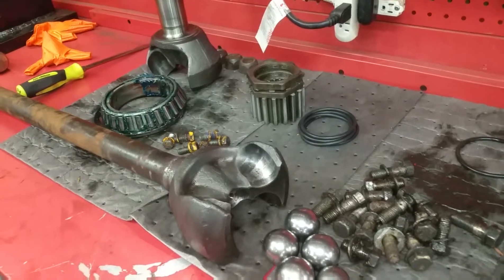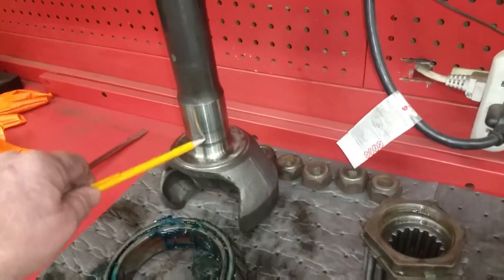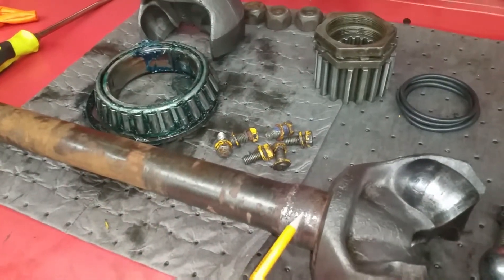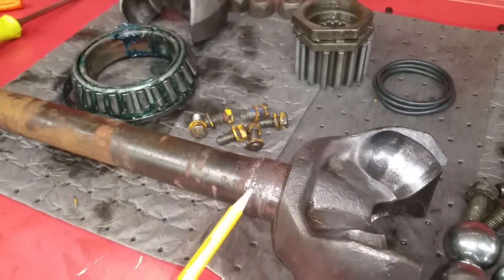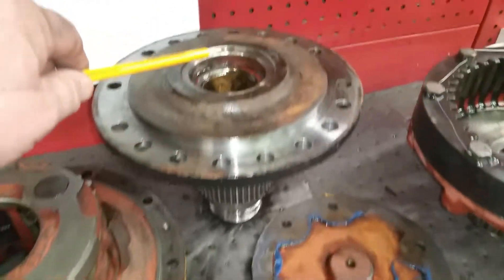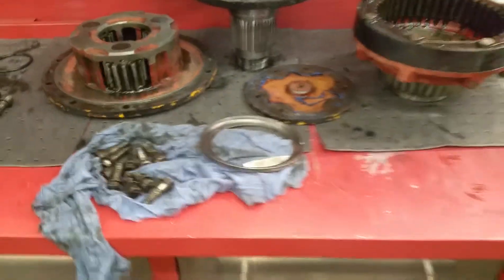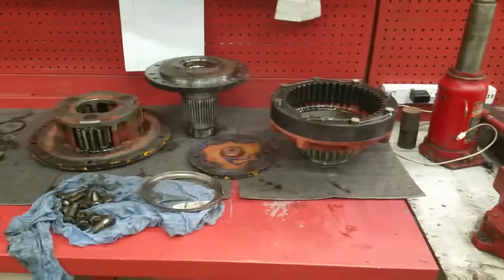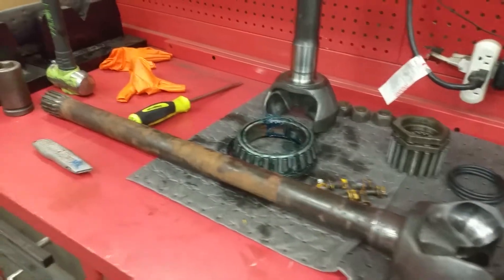There are some worn issues we have to deal with on this setup. You'll notice how nice and smooth this one is over here, but this one has been pitted — you can see how it's been pitted, and that's not good. The race in here also needs to be replaced, and there are other damaged components that have to be addressed. We're going to take all four wheels apart, open them up, check the bearings, check everything, and get it back to snuff so we're ready to run next season starting in April.